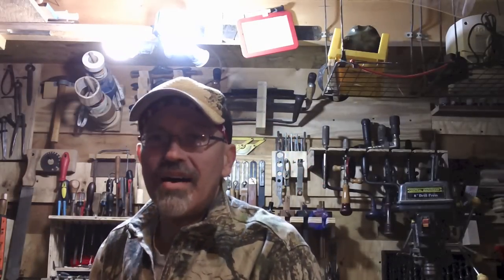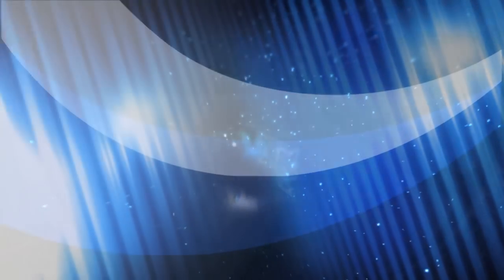Once you've got your steel filed and shaped, you're not going to do any more grinding. You're going to put your final edge on it and do your polishing. Then you want to quench it. You've got the steel to the level that you want. First, I would get some burnt motor oil — it's got carbon in it and everybody can get their hands on some. If not, you can use any kind.